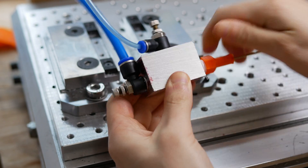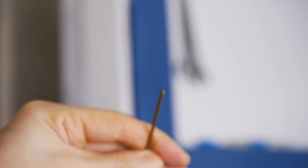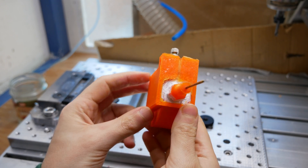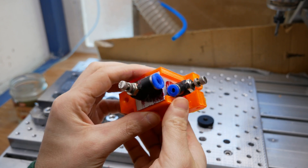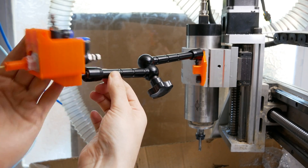The same goes with the 3D printed nozzle part — I loaded it up with Teflon tape as well. For the nozzle, I used a 2mm brass tube sourced from a model-making shop. It has an inner diameter of 1.1mm, so it lets out just a tiny amount of liquid, which is exactly what I wanted. This push fits into the 3D printed nozzle section, and I sealed it up with superglue. I should have designed the aluminium block with space for a threaded hole, but since I didn't, I had to 3D print a casing to hold it — it makes it a little big and chunky, but it does the job.